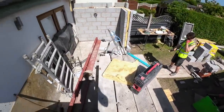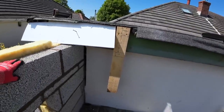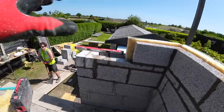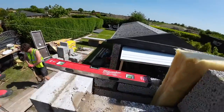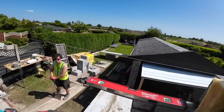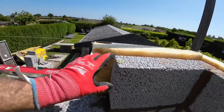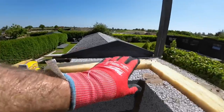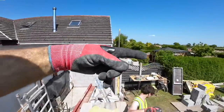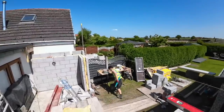So anyway, that's up. I'm pretty sure that's ceiling height now. If it's any different, we'll find out tomorrow and we'll add to it. Obviously, there's your steel height, steel to go on, and then block to go over the top. More cuts to go over the top of the steel because the steel's only 160, so we're going to end up with another few of these thin cuts across the top. And then the wall plate is just across the front.